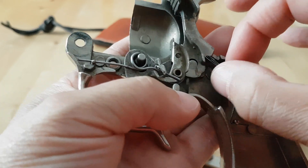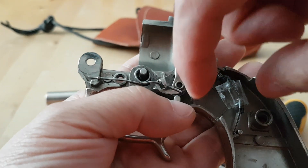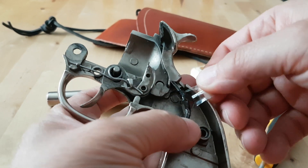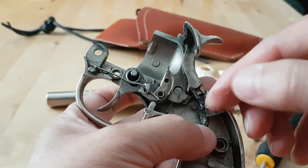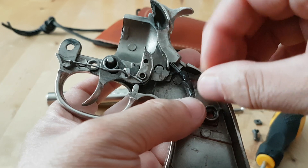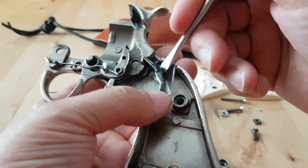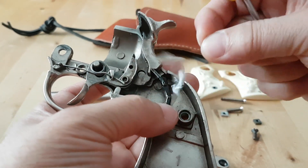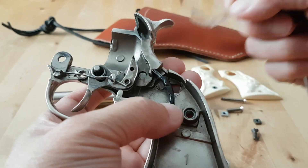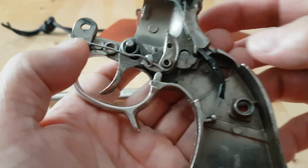There's a bit of sellotape there that's not so sticky anymore — I only put that sellotape on at the end, and there's another piece of electrical tape underneath. What I did to fix the spring was use several pieces of thin sprung steel, cut them to various lengths, and through trial and error slotted them in to get the right tension when you pull the trigger back. It's literally just wrapped around a strong piece of electrical tape. I don't really need that sellotape — I'll cut that off later. I've now got some shrink hose that I could put over that, apply a slight bit of heat from a lighter, and it would shrink around that bit of tape.